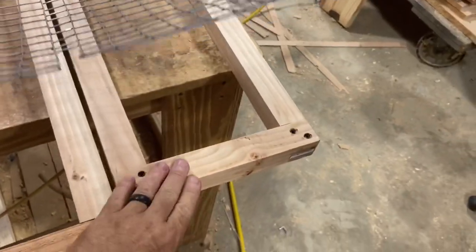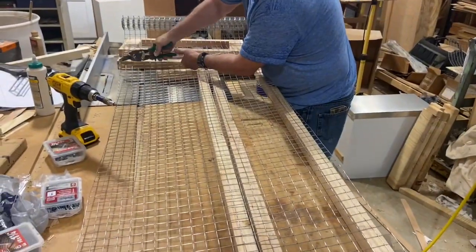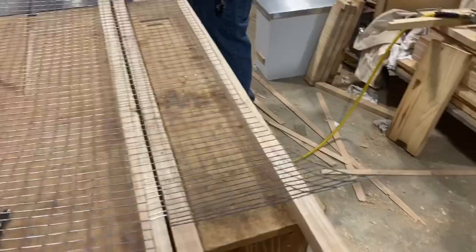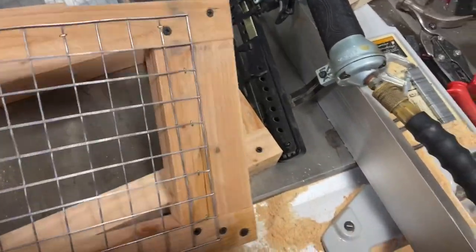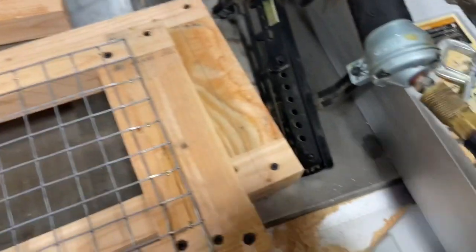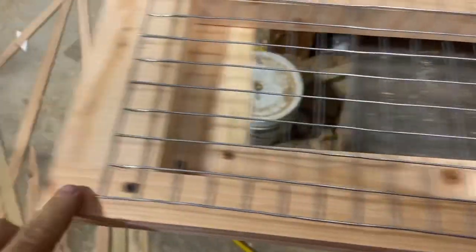So this is the back assembly and this is the front piece assembly. What we're doing now is measuring this one-by-one square fencing, cutting it to length first, then to the appropriate width, and then we'll staple it onto the piece of wood. This is the end piece — it'll sit up like this. The one thing you've got to remember is you have to draw a line an inch and a half back from the edge and don't let your wire go past that line, on both ends.